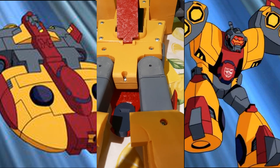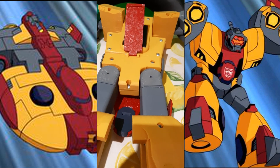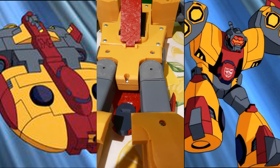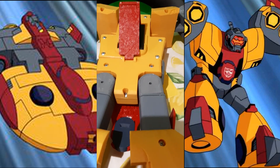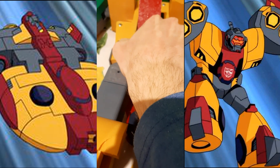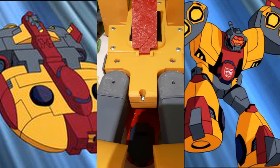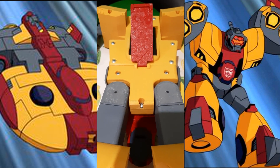I know someone's going to ask in the comments why don't you just edit the actual main hip ratchet piece and just change that thickness. The reason is I've not actually designed the majority of parts here at this location. The version of SolidWorks I have is 2019 and the version I worked on elsewhere was SolidWorks 2020. So that's where the problem comes from and why I'm going to have to make it a separate piece - otherwise I'd have to pop the STL file into SolidWorks and completely redraw it, reverse engineer like crazy.